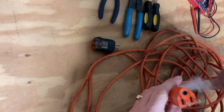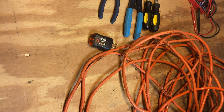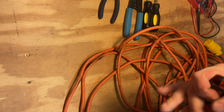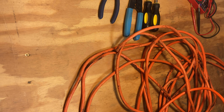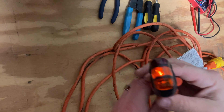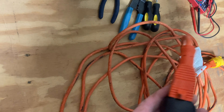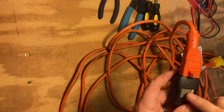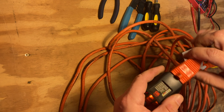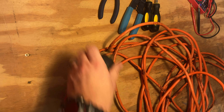Same deal. Let's turn our light back on. We have a busted prong. I'll plug it in over here — I like to complete the circuit before I energize it, but that's just me. So that guy's plugged in. We plug this cord in and look at that — we have one light. The middle light is lit, red's not, left side's not. I look at the chart and it says: open ground — nothing, yellow, nothing. Sure enough, pull that off — that's about as open as you get. So unplug that.